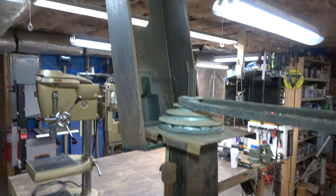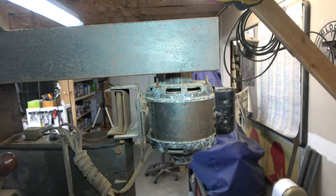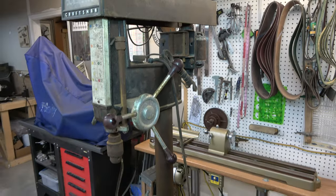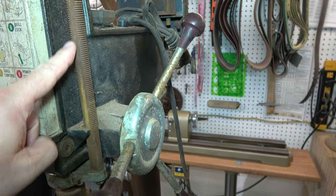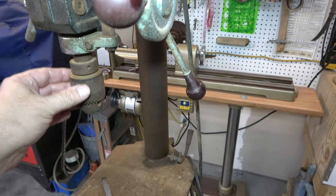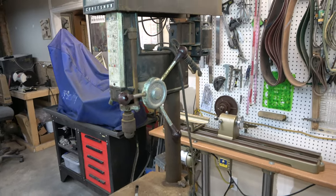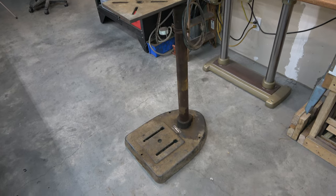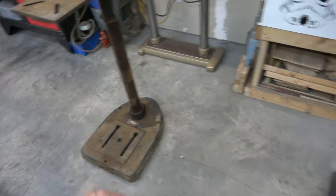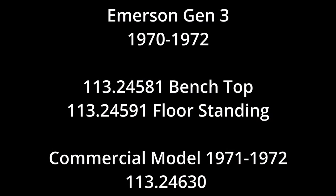The Gen 2 is still using that half-inch by 45 V-belt, and the motor mount is very different. The hub and the feed stop rod is almost the same, though this one's actually about an inch longer. Same chuck, same chuck design. There's your feed stop rod from a 150, and there's the Generation 2 — same feed stop collar and everything. The table is obviously very different. The Gen 2 was identical to the Gen 1 in capabilities, except the Gen 2 had a longer spindle travel.